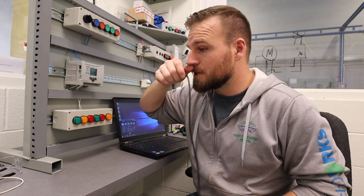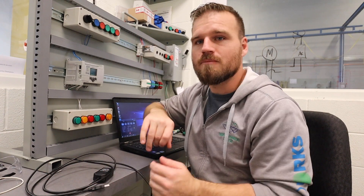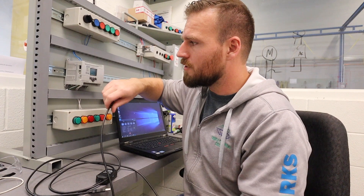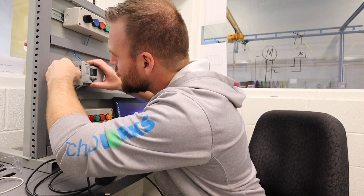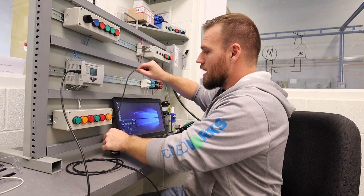It will be shaped exactly like the plug-in on the side of the PLC. This PLC can be connected to in two different ways: Ethernet or serial port. There's not very much that uses a serial port anymore, but we're going to use it. We'll get into Ethernet probably way later down the road. So we're going to take our serial cord and plug it into the side. Be careful that you don't plug it in the wrong way — it has to be oriented correctly, or you could crush the pins or damage the port. Then take your USB and plug it into your computer.